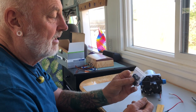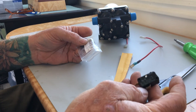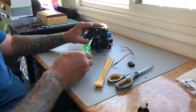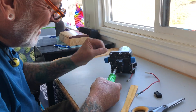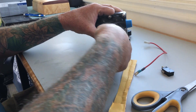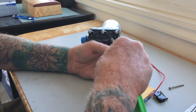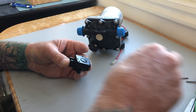This little micro switch and the contacts — that's all that stands between us and a functioning water pump. You can totally feel the difference with a new one. That little allen screw in the middle adjusts your pressure. Three simple screws, and that's the diaphragm that pushes down — when it pushes down it triggers the micro switch.